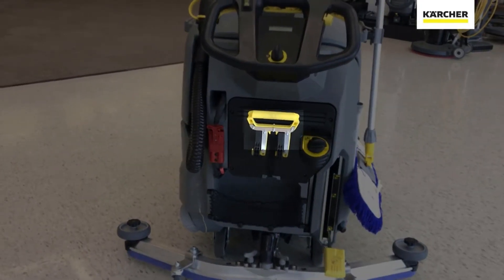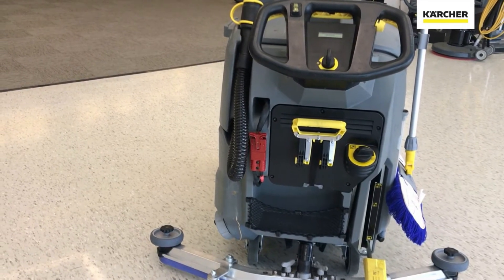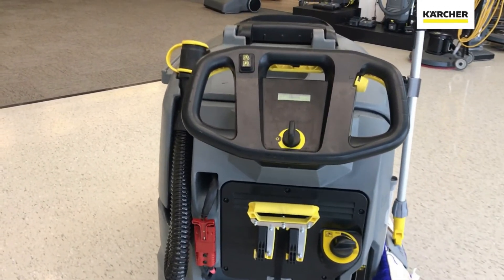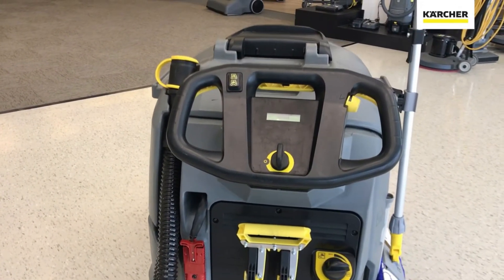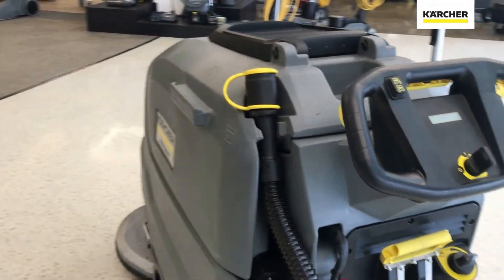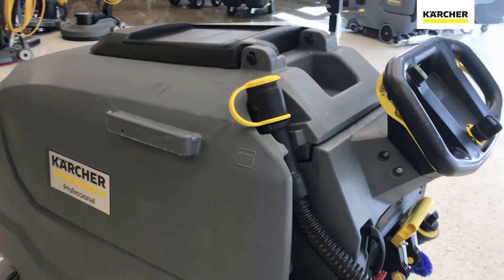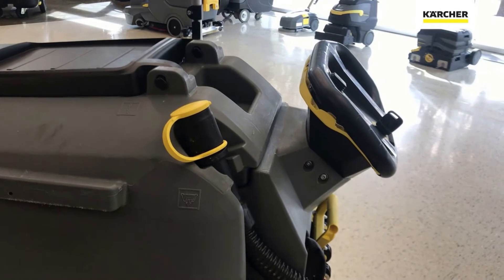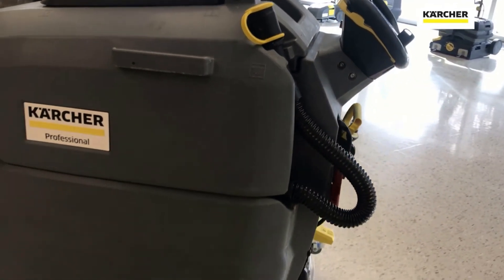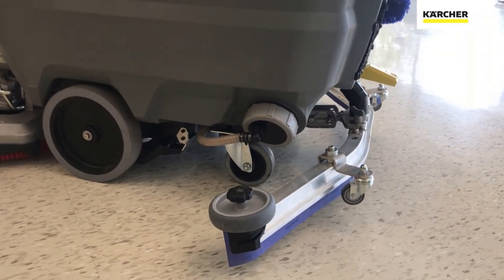Again, no actuators, keeping costs down. The red Anderson couplers for the stand-alone charger are located here as well. There is a keyed on/off switch and a speed control when desired. The dirty water dump hose is here with its yellow daily operator touch point. You also see the yellow portion of the yoke — when you wish to engage the scrubber and start moving, you disengage the yellow portion to the black portion. The same light gray service touch point is used for the clean solution dump.